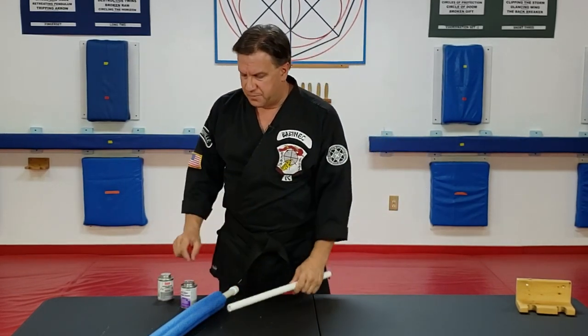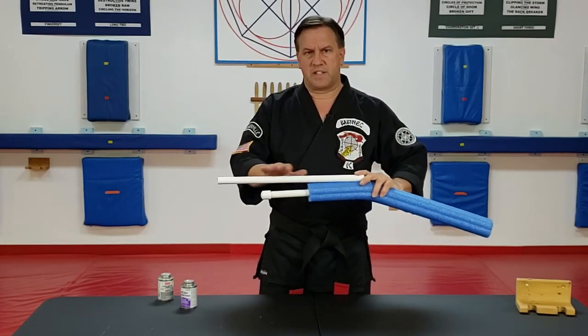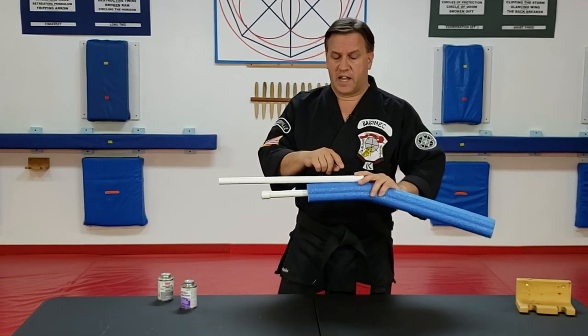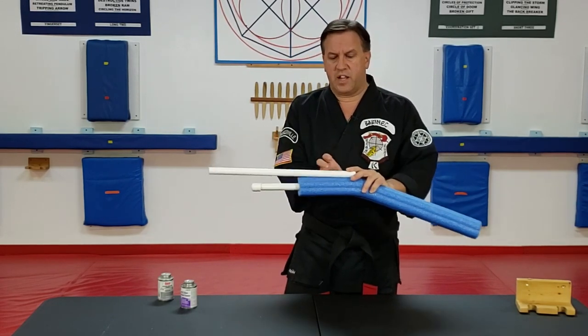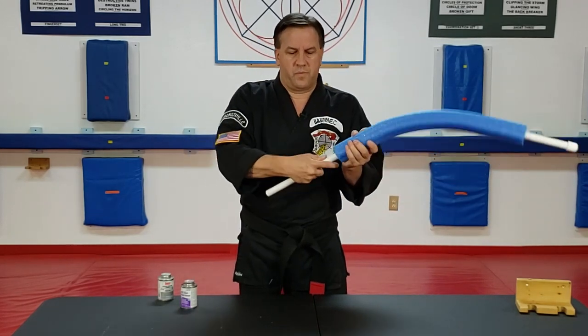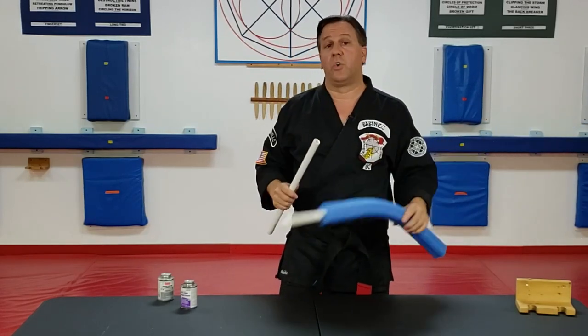Make sure the printing is off. Put the cleaner on just the part that's going to go in — I try not to mess up this area over here. So I clean this off, and then I put the cement on, only up to about here. And then you just push it right in like that.